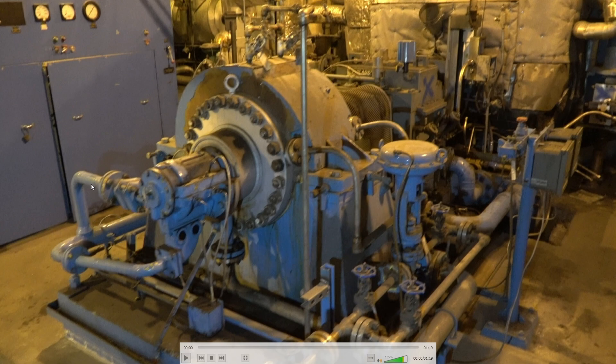You can see it has a guarded oil pipe. Your supply line comes through here, return line goes through here. The lines are inside this line — the high pressure oil is inside and the return runs down it, so in case there's a leak it doesn't spray, it stays right in the system. This prevents fires. Turbines are notorious for having huge fires if you ever have an oil leak due to the high temperatures.